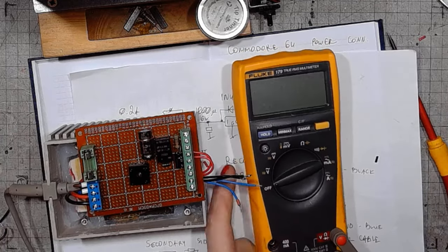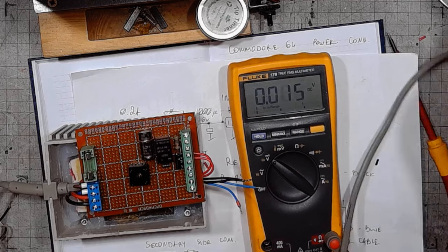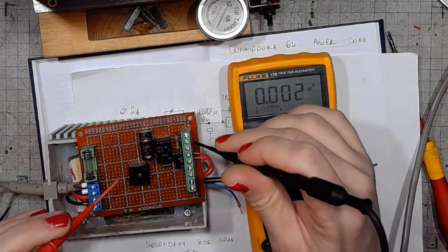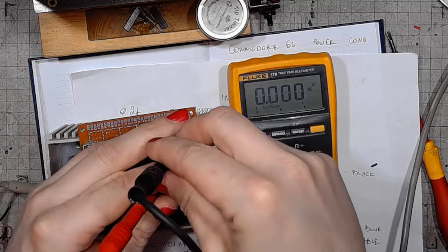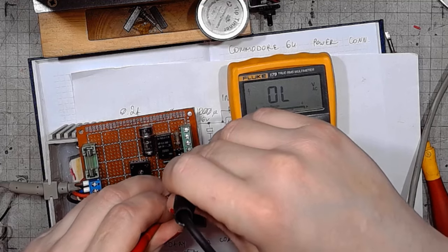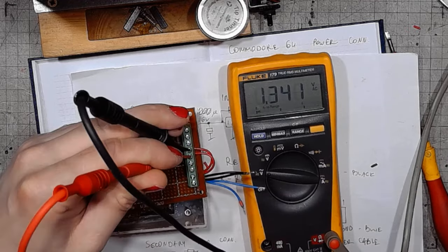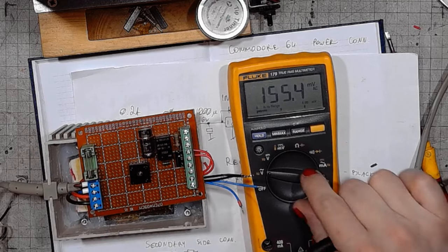And the moment of truth is coming. I'm plugging this into the device under test socket on my bench, powering up, fire to the wire. And here I had the ground. Here I had plus 5 volts DC, but it doesn't seem to be working. I wonder why. Did I get something wrong here? Half a volt? Why? What's going on?